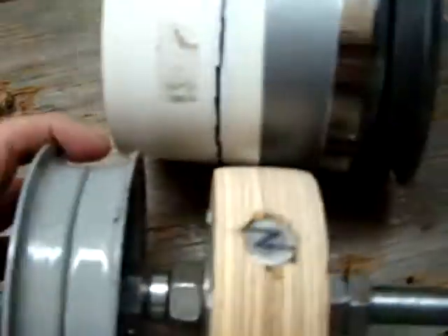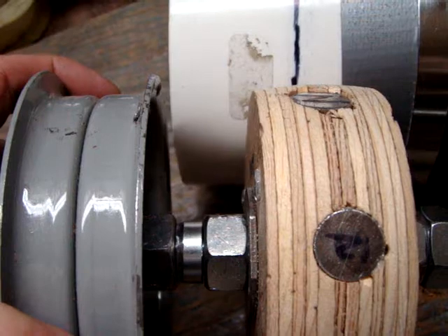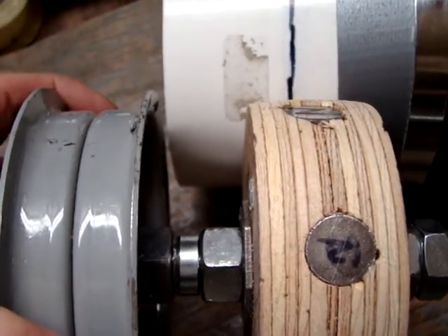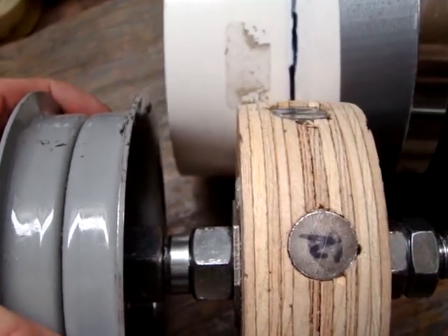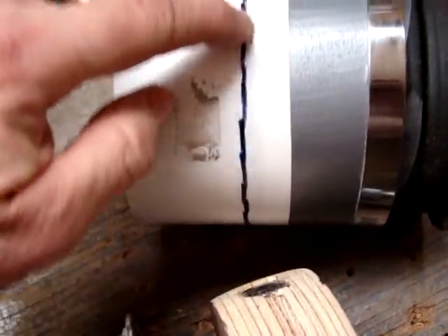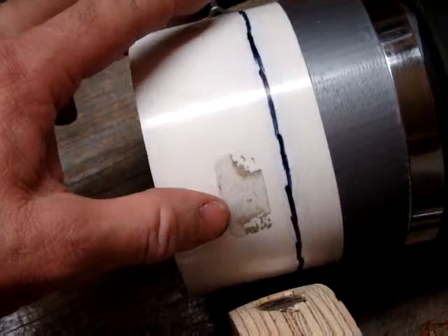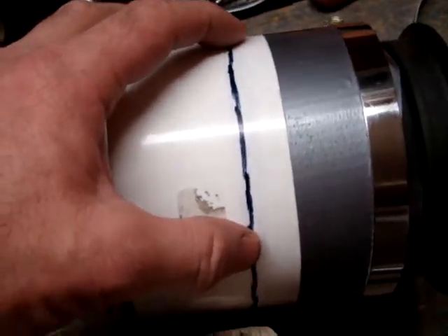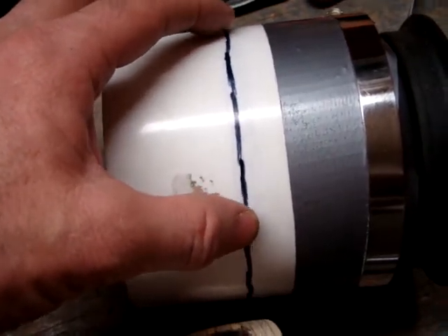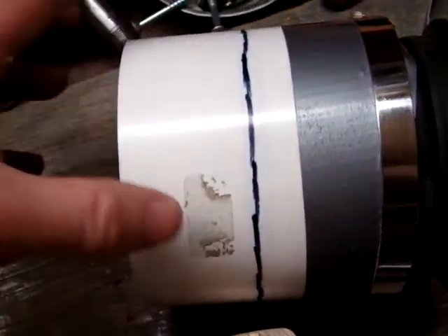Therefore the end of the coupling — so when it fits inside the coupling, the magnets rotating will be aligned properly along the center point, which is where the coil cores will be arranged in a radial arrangement. There will be nine coils and they will be in three series triplets for a three-phase system.